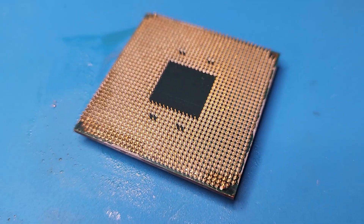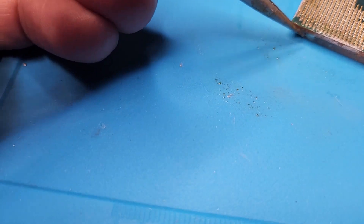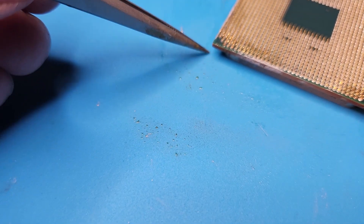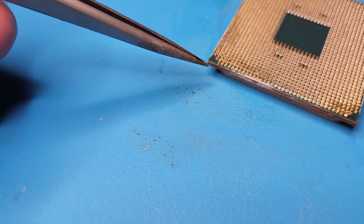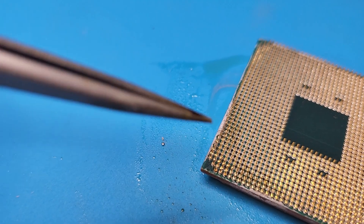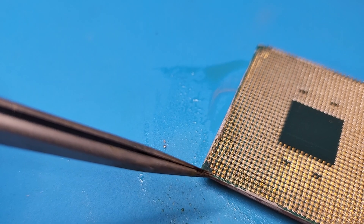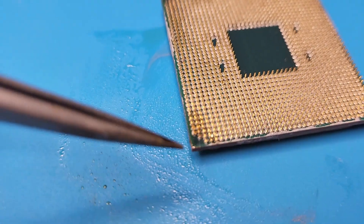It's done. Being able to brace my arm on a desk like I showed you before made a huge difference. This mat actually really helped too. That one went perfectly. I use these locking tweezers so I'm able to lock them in. Once I see the solder melt — I actually have some solder on this thing that I'll test the temperature with to make sure it's what I want, and that's a pretty good guide. Once the solder melts, you put it on, you leave it in place, then pull the heat gun away right away so it closes up. Slowly let go and pull your tweezers out so you don't knock any other pins. That's the name of the game.